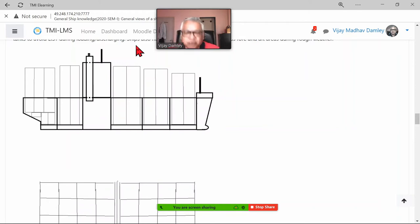So, from there, everybody knows the weight is so much. In case there is an odd ship where the weight is higher, it can happen, but generally you will not see it. But nobody assumes the weight. Because all these QCs, or all the container handling equipment in the port, have built-in weighing scales. So, when they lift it up, they get a reading saying that it is overweight or whatever it is. They will get an alarm. Got it? Yes, sir. Got it.